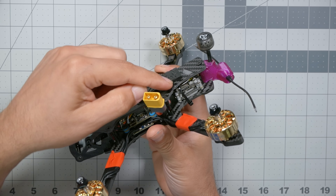You may want to disable this option anyway, because if you're using the DJI smart controller or the Digiview app — an open source free app that lets you get video out from the USB plug to a PC or Android device — you need the temperature protection option turned off; it gets in the way. Also, if you've got temperature protection turned on and you crash far out there and then disarm, it goes down to one milliwatt. Now you can't find it. So some people just prefer to have temperature protection off and run at full power all the time.